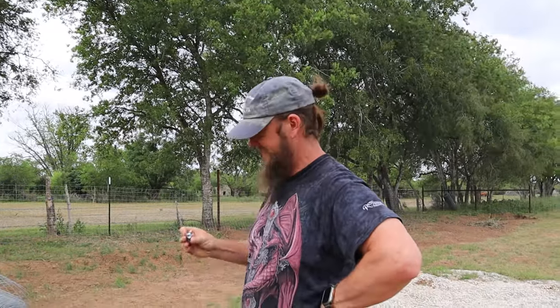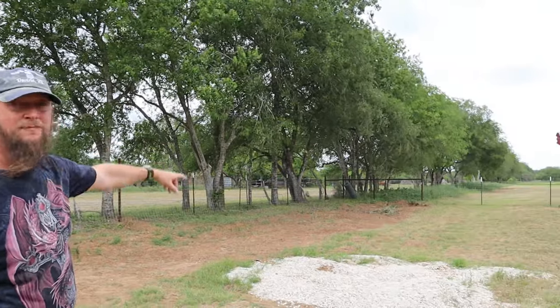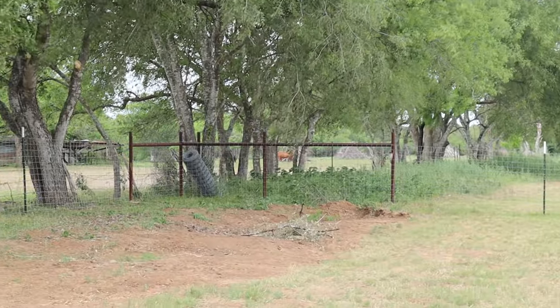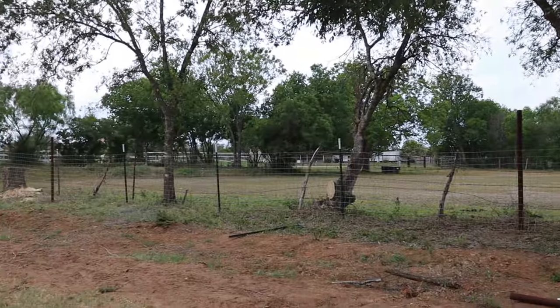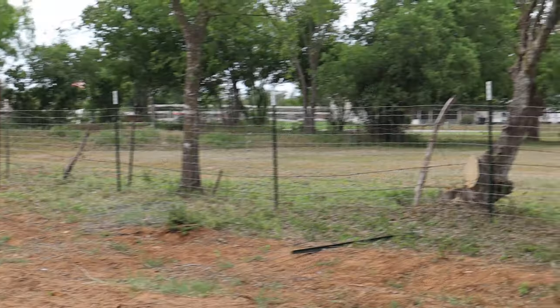And we went ahead and got the fence up, but not tightened, because we ran out of the gripples that we needed. Just these little guys right here. I had enough for that side over there. Didn't have enough for this side, so we're actually using the weight of the roll to keep the fence up. And then with those two pieces, I used my connector gripples over here. So what we're gonna do is put these end gripples on that side over there, and then we'll tension up the fence and cut off the extra slack and reuse those gripples, and we'll have this fence done finally.